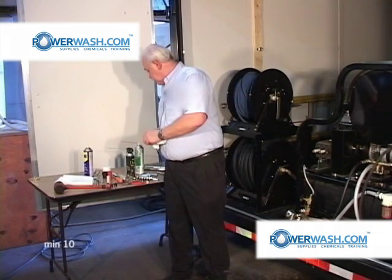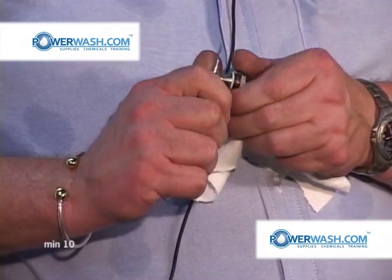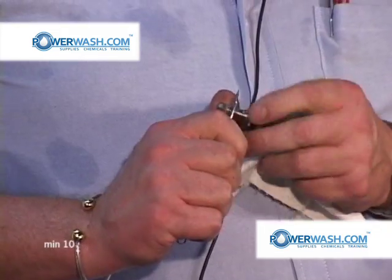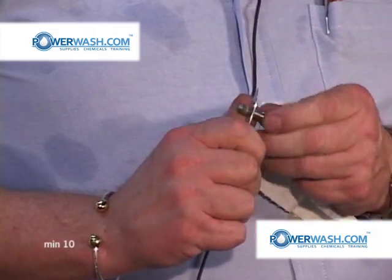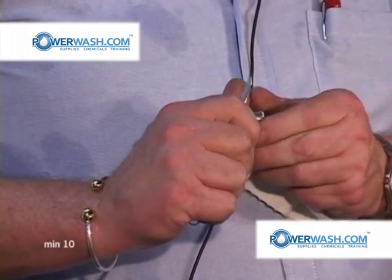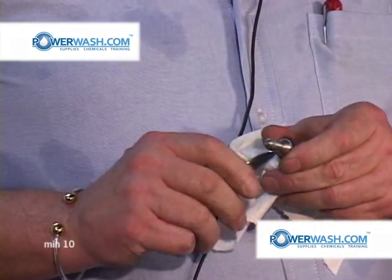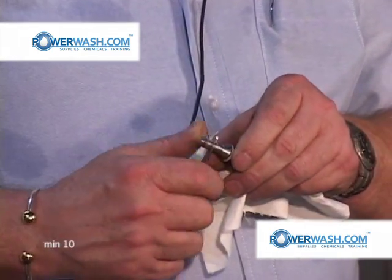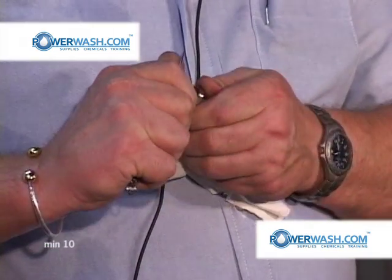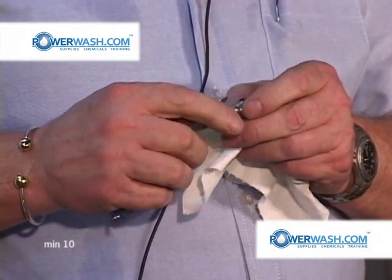In this case, I'm just going to use a pocket knife and chase the threads out — get all that dried Loctite out of there. If you have a small wire brush or something like that, it would be helpful to use that. But you do want to get them good and clean. If you don't, when you replace them, the Loctite won't hold.